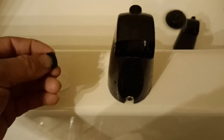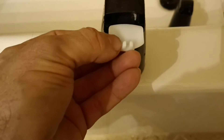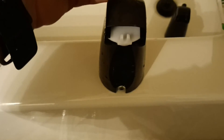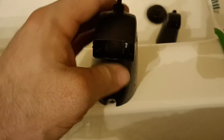Once you've got that cleaned up, you're going to put your repair kit together. You're going to have a gasket that has a hollow side and a flat side — the flat side with this little ridge on it is going to go facing out. Then with the other side down, slide that in place, take your plunger and put that on top, then just press until they click. That's it — now you've got it working again. Then you just put it back on the conduit or the copper tubing, tighten it up, and give it a test.